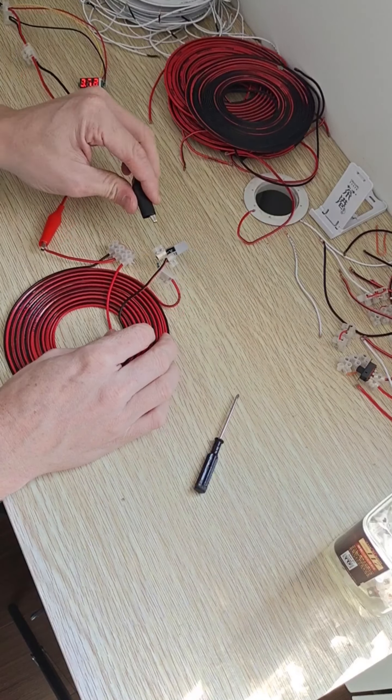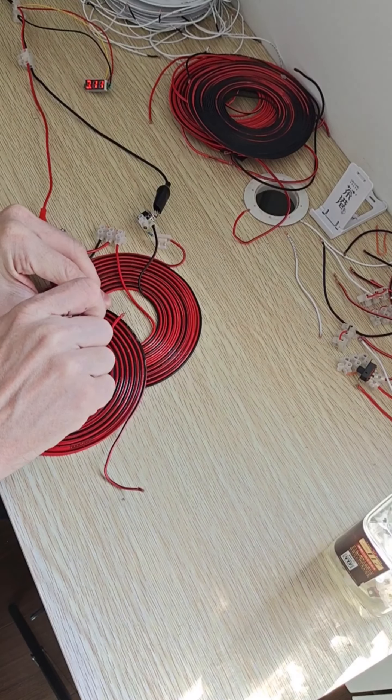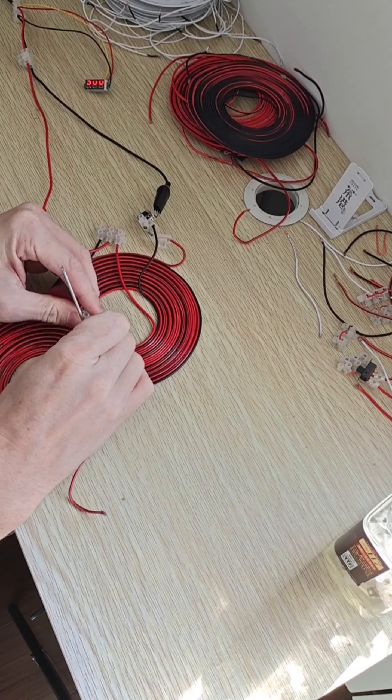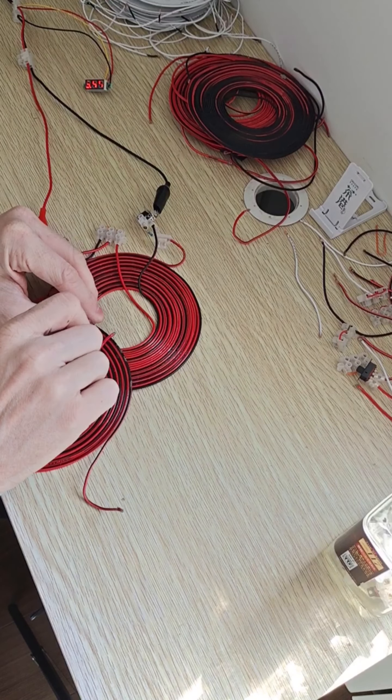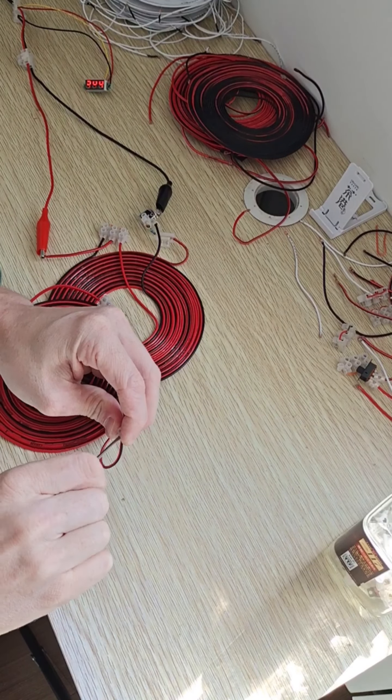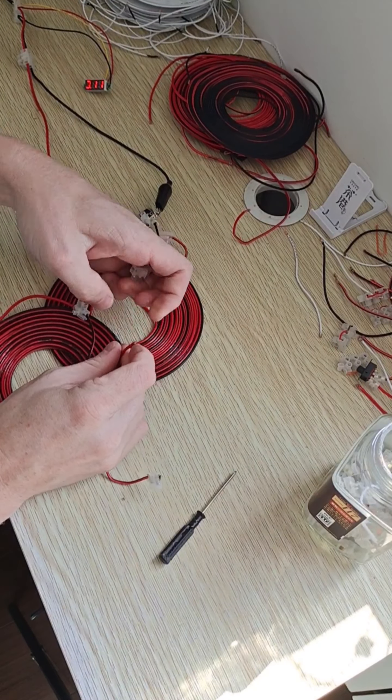So after that you're going to use another pancake coil. In this situation I can simply center tap it. The inside wire is the black one and the outside wire is the red one. When you're stacking them or using them to receive the power, you're quite happy just to do the center tap like that, and then you've got your outputs on either side. Of course it's AC power because the TIP31 is putting out a pulsed AC — essentially it's AC out. So you're going to have to rectify the output if you want to charge a battery or something. There I've got center tap tapped on my two outs.